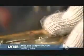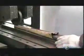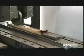Then, with a brass-headed hammer, he taps down the notches so they hold the edges together. With an acetylene torch, he joins the notch seam, melting in a brass alloy wire to bond it securely. But the seam overlaps and it's too thick, so he runs it through a seam roller. 2 tons of pressure thins it, but now the bell stem is too flat.